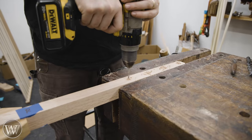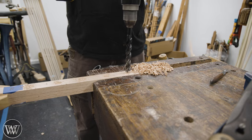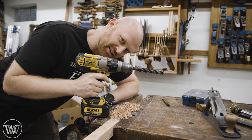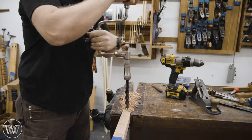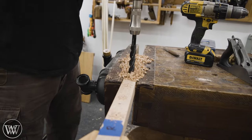Because they are rather thin, I'm going to drill a pilot hole all the way through. The first one I didn't, and I had a little bit of splitting, so I stopped and drilled the pilot hole — especially with the auger bits, having that snail on the front that twists them out. I actually ran out of power on my drill, so of course that means I need to bring out the brace — well, no. I just got a new battery and it goes pretty fast.